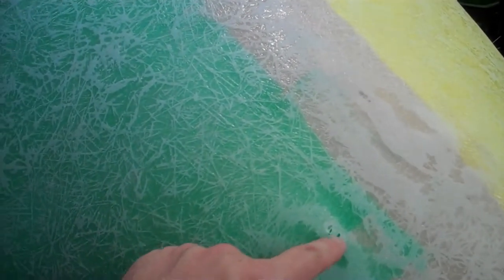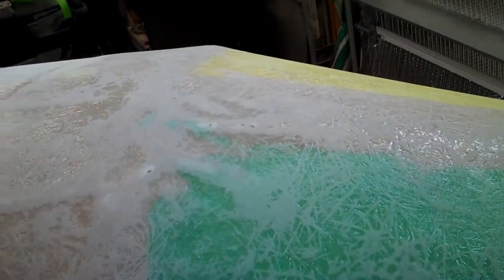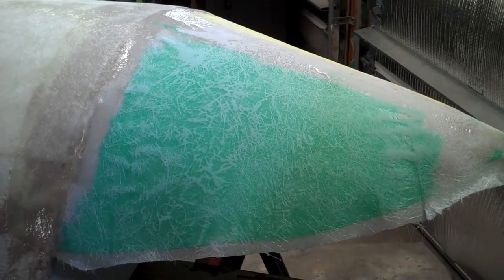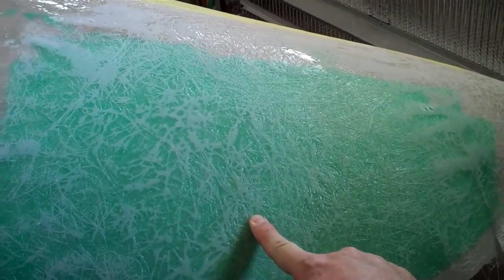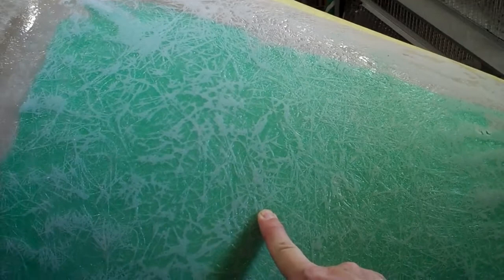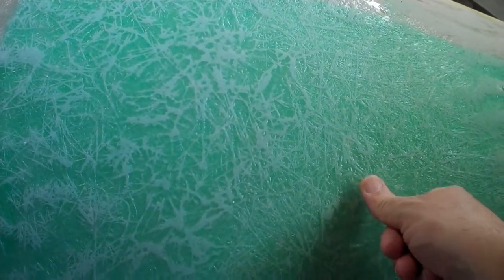The vacuuming step removes all of the excess fiberglass dust from any depressions in the surface. You can see areas that used to be raised ridges, some of which cut all the way through, but that's okay because we want it to be mostly level and the next layer of fiberglass will cover all that up. To give you a feeling for the rigidity: this is two ounces per square foot chop strand mat with a liberal amount of epoxy resin on it, and behind it is the foam. Where there's no support behind it, I can visibly flex it in by pushing with my thumb.